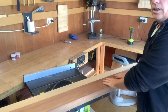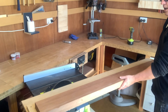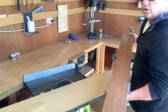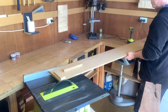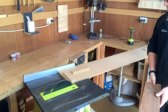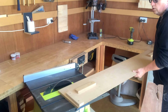I've got this little bit of kauri left over — quite a long plank of it. It's bowed down the length, so I've made this jig for straightening wood on my table saw. I'm going to take it — it's all set up ready to go. I've put these blocks in certain positions along the tube.